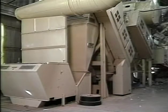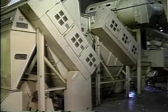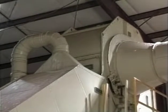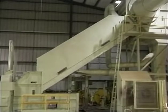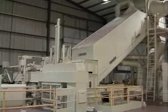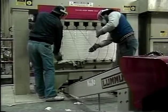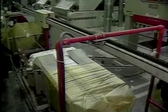Lint cleaning in roller gins is different from saw gins — they are much gentler, doing very little damage to fiber quality. When ginning and cleaning is finished, the cotton proceeds through the lint flue to the battery condenser, which removes the fiber from the air stream and forms it into a bat that falls down the lint slide into the press charging box. The tramper packs the lint until the bale is finished, then the press is rotated and the large hydraulic ram compresses the bale and holds it while strapping materials are applied. When the bale is finished, it is removed from the press and is ready to be made into high quality comfortable clothing and textile products.